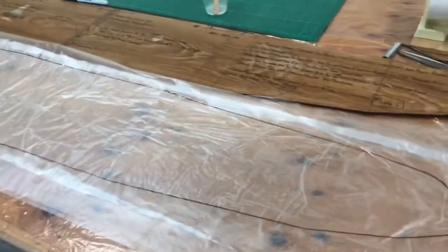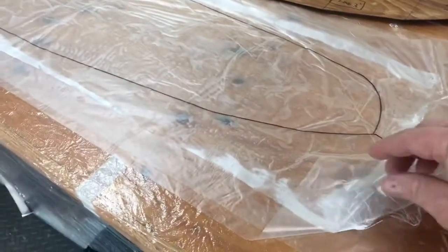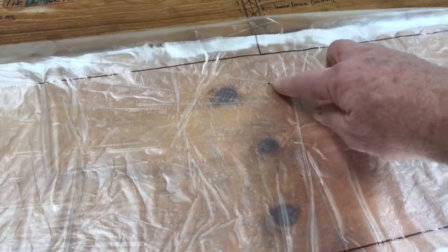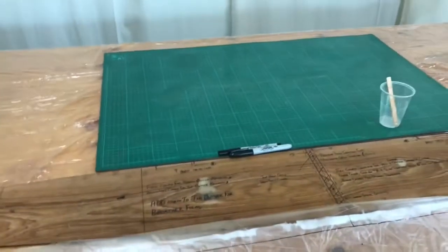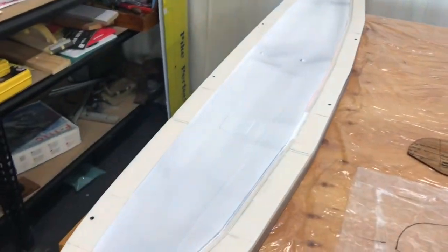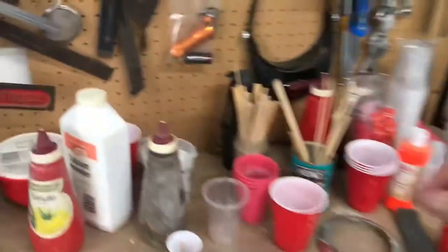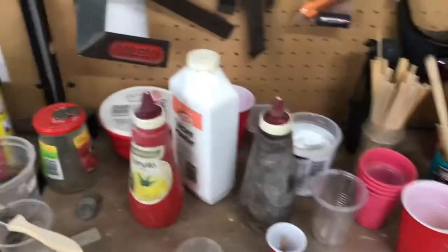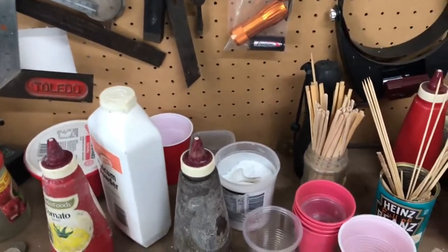The veil cloth is wet out and I've got the second layer of freezer film over the top. I've drawn around the template with a couple of bolt hole spots marked, and it's ready to move over to the cutting mat. I'll run around it with the roller knife and transfer it across to the mold. The mold has been brushed with epoxy and I'll mix up what I call my joining filler mix - 50/50 colloidal silica and cotton flock, give it a good mix, put it through the sieve to take out any lumps. I'll put that along the leading edge and around the servo bays and bolt recesses.